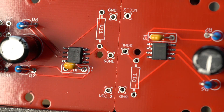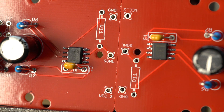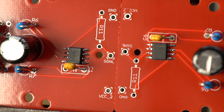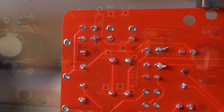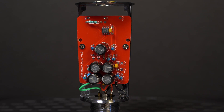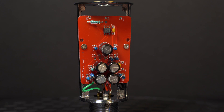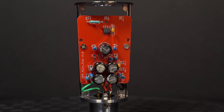Don't worry if you lose track of time because the oven is cooling down anyway. Here's what they look like post-baking — my soldering looks way better when the flux is cleaned off. Note that we have not installed the 1 gig resistor yet; we're going to do that right before our build. This circuit can be used for both a condenser microphone circuit and a piezo contact mic. The only difference is substituting a 1 meg resistor for the 1 gig resistor.